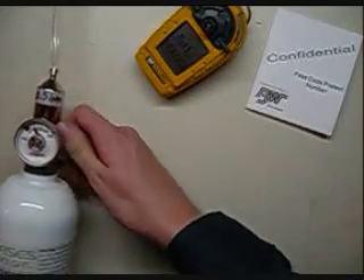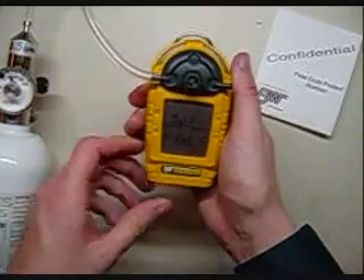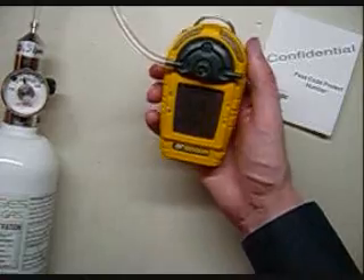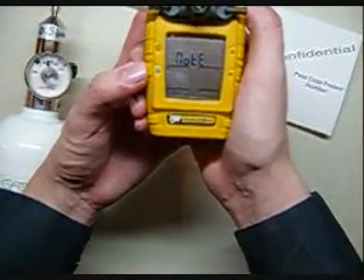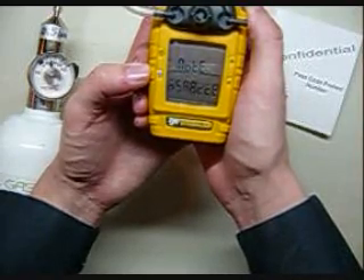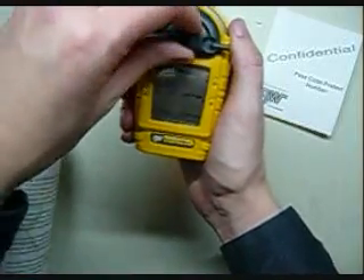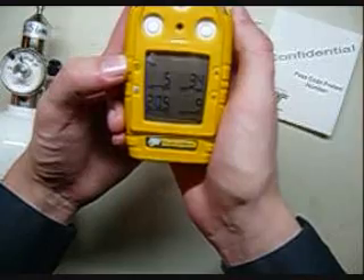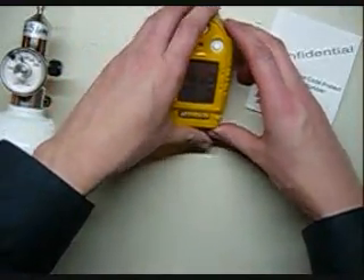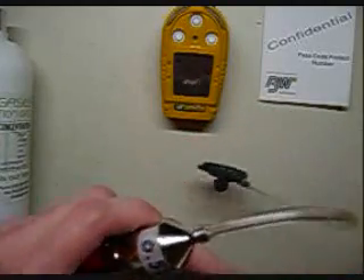Okay, now we're all done. First thing you do is turn off the calibration gas cylinder. Now, the first thing it's saying here is that the calibration gas is unusual on this one — that's because we had it off when we started. So just hit accept, and put the button on the blue on the left. Now it says span accepted. We originally had some different cal gas on here. Now it's going to go into a full reset — it'll show the alarms, just click the upper left button and let it go down. Now it's going to reset to zero. While that's going, take the regulator off the cylinder of calibration gas. You never want to leave a regulator on the cylinders in case it tips over or falls off — it'll break the valve, any number of things can go wrong, so always take that off.